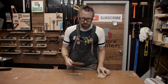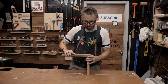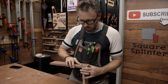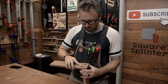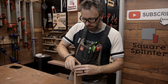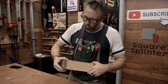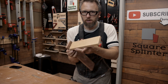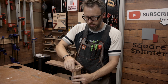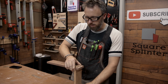All right, we got sloppy cut tenons. We got 2 big round holes in our board. Now it's time to make them look good. Okay, so what I'm thinking is we might super glue these boards together so that they're even this way and so that they're square and they don't move around. The super glue is not gonna hold it permanently, of course. It's just to hold it so we can get the epoxy poured. Then I think we can turn this over, and on the back here, we can dam that up either with some tape or something similar. And then we can mount this like this, pour our epoxy in the top, and that's it. This is gonna be delicious.